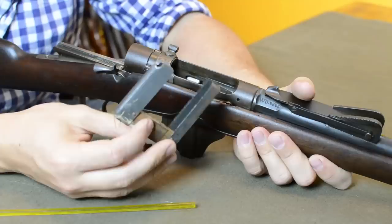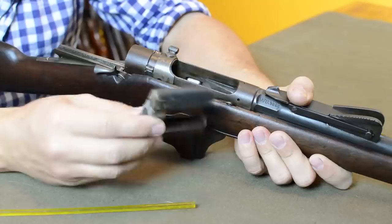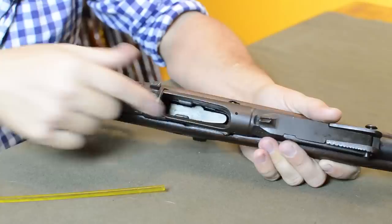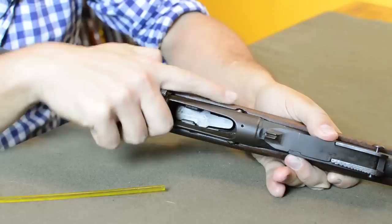A lot of countries had no loading systems — most of them were still in tube loading format. The fact that the Italian army really resisted going to a tube loader and instead went with something like this is very advanced thinking. You may see some notches here — that's where two long springs have been set. They form these interrupting springs; these heads go all the way down the outside, there's a relief cut here and here in order to get that all set up, and then they're screwed in. That's going to be important on our next episode.